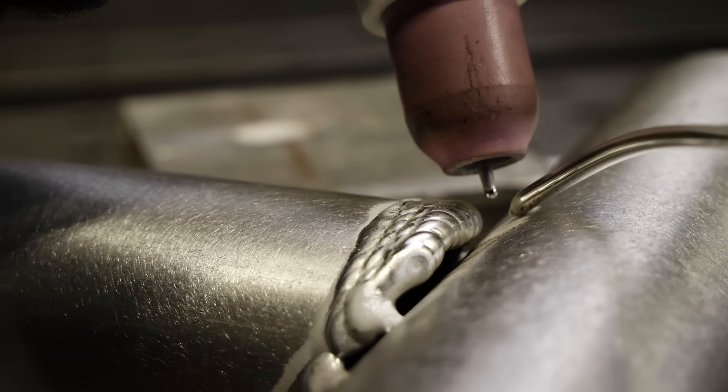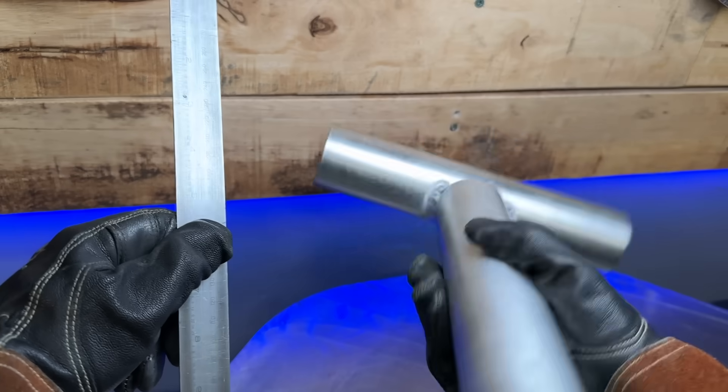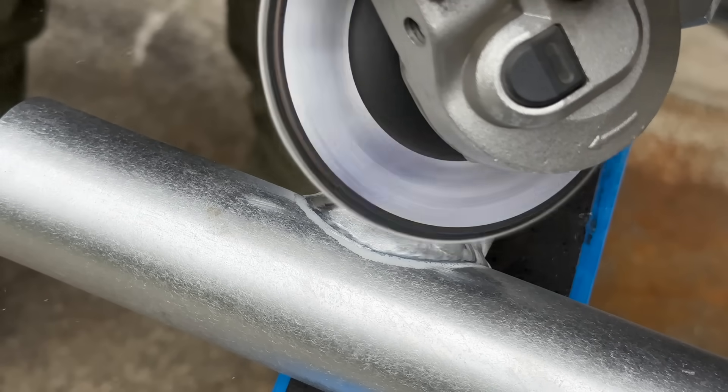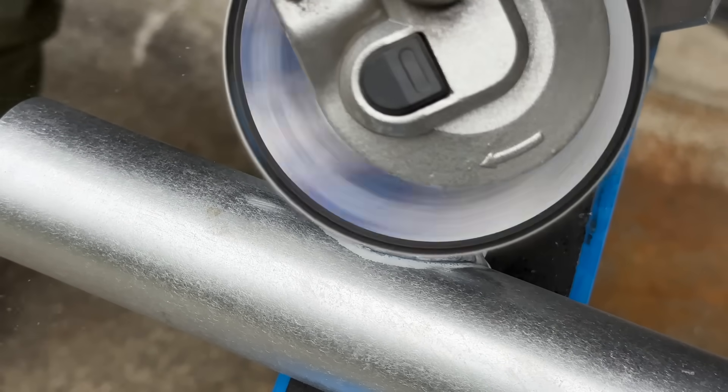When I've reached out far enough and I'm starting to actually bridge to the mating part, I'm going to make sure I get in with proper heat and that the amount of filler I'm using is enough but not too much. I've basically bombed this whole gap with good heat and good filler step by step, trying to keep things clean each step of the way. Checking in with my ruler, you can see things are flat — no hollow or concave areas. I want to use my grinders to create the same profile of the pipe all the way to the mating part.